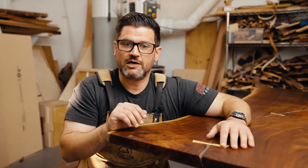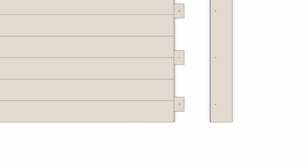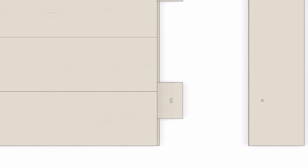Let's take a look at this farmhouse table. You can see we modeled it in CAD to show that it's going to expand and contract across the width. In a farmhouse table like this, you would use a breadboard end. You're going to put glue in the center hole with a dowel, but on the two edges the dowels are not going to be glued in, because you want them to be able to move back and forth as the table expands and contracts.